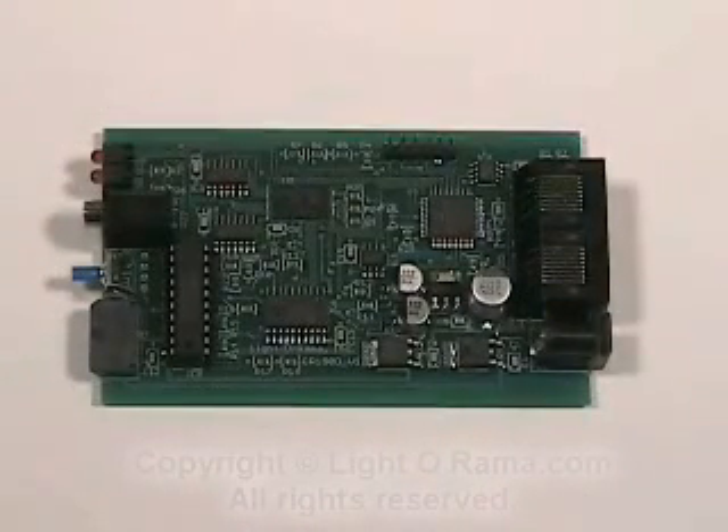Finally, I wanted to show you the controller. We don't have the aluminum boxes yet so I'll just show you the circuit board. On the right-hand side you can see the two RJ45 connectors to daisy chain it into the lower network. Below that is the 12 volt DC input power barrel. On the left-hand side at the top are two status LEDs. Then there's a 1/8 inch stereo jack — that's how you get at the two trigger inputs for interactive shows or stand-alone. The blue reset button is below that, and on the lower left is the ribbon connector. The controller has an accessory power supply so it can be used with wireless or one of the show directors. It also has standalone storage for 10,000 commands so it can direct itself or other controllers.